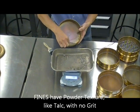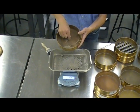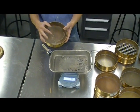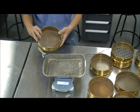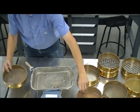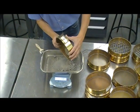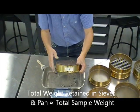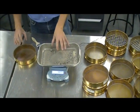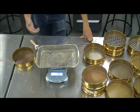As you can see, it's a powder — you don't feel any grittiness because it's like a talc-like powder material. This tells you that these are particles smaller than 0.075 millimeters, or in other words, particles that pass through the number 200 sieve. When we complete the experiment, we'll have a total weight of the sample which will add up very closely to the number we started with, and we're going to illustrate that in our calculations spreadsheet or manual calculation.